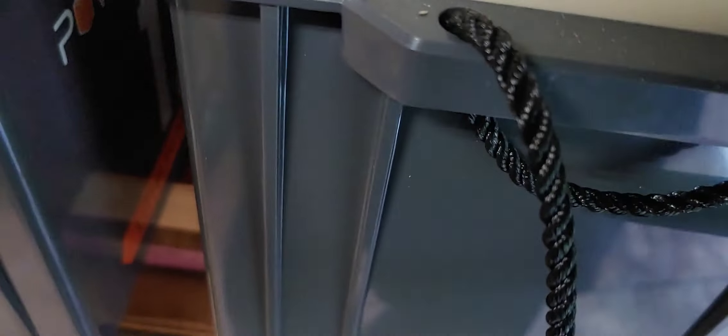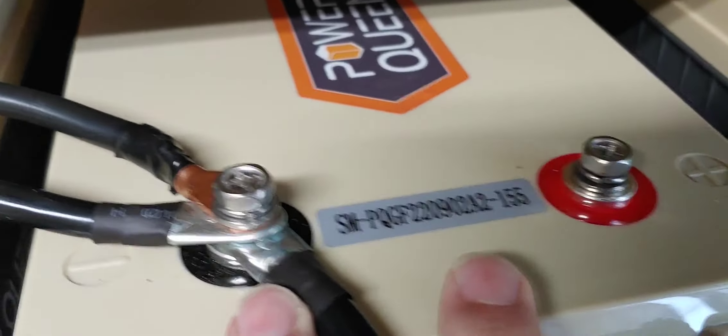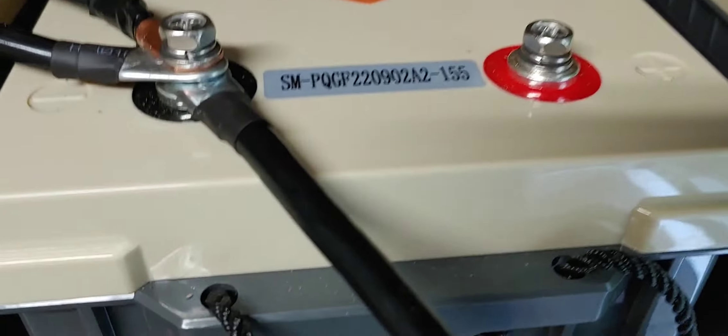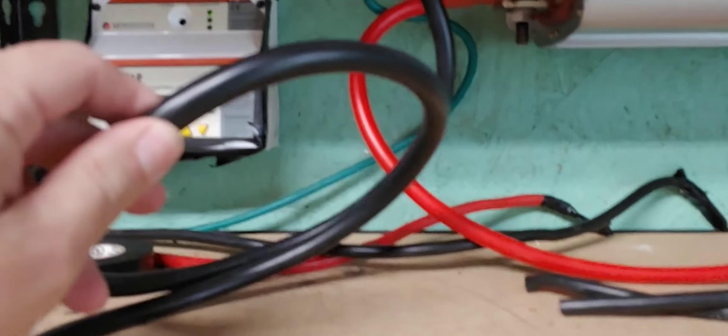Now when I'm doing the center one, it's a little different because it takes three cables — it's getting one cable from the charge controller and then one to connect each of the batteries. I put the charge controller cables on this one battery because discharging is more important than getting electricity from the solar panel in, as that will distribute pretty well. So you can see there are three on this one. And as you can see, my charge controller is coming to life — it says 13.8, and that is a good reading for these batteries. Everything's been set up red to red and black to black.